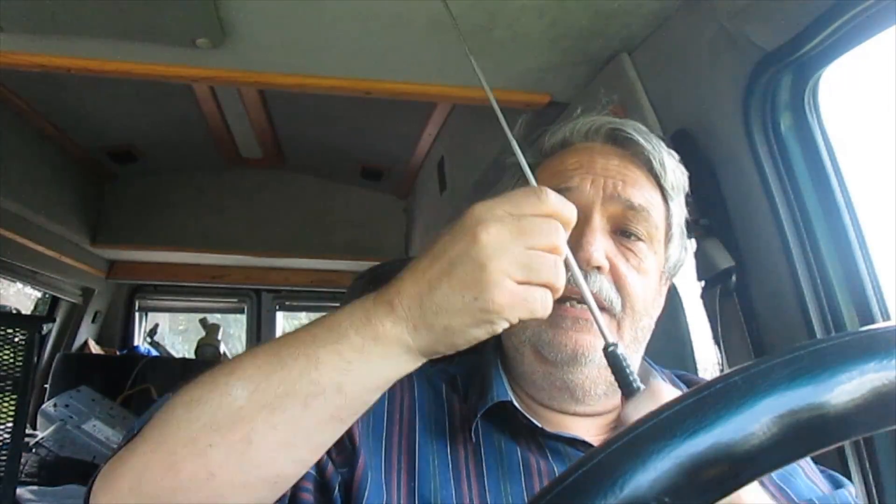This antenna will work for both 2 meters and 440. If I want to use it for 2 meters at its most ideal setting, I extend all but one segment and add this coil — now this length, with the coil added, is more resonantly tuned for 2 meters. I'll get a much better signal with this than I would with a small rubber duck antenna, because it's closer to the ideal length. Not only will it receive 2 meter signals better, but it will also broadcast them better — because this antenna matches the frequency, it puts more power out for others to receive.